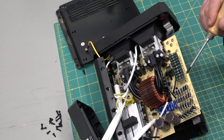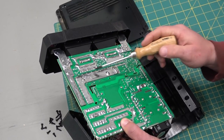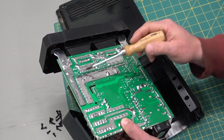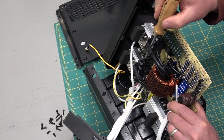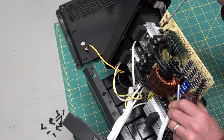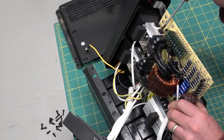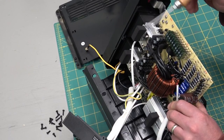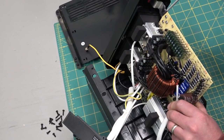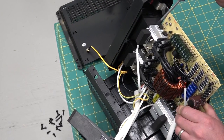We have all these angry pixies, lots of them, going through these fuses and through the traces on the underside of the board. Over here is the DC bus — these are capacitors, of course — so they will filter out some of the noise, not all of it. The noise is going to be coming from the input side of the switch mode. These transistors will be switching very, very quickly, on the order of 20 kilohertz — 20,000 times a second. That induces a ripple on the input, and that creates heat.